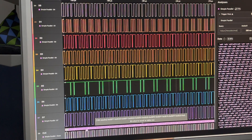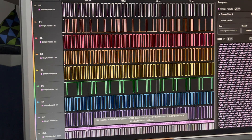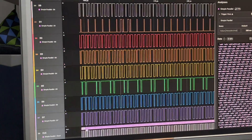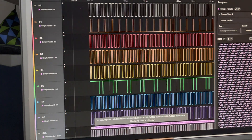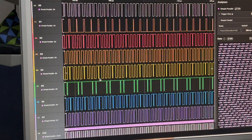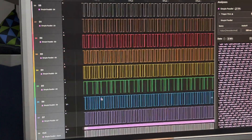I can see down here: FF, 20, FF, 20, FD, 20, FD, FF, 76, FF. A lot of FD 20 FD 20 FD 20 7F FD 20. I don't know if this is a wild goose chase or a red herring — maybe I'm looking at the wrong thing. But that's the data the Z80 is producing.